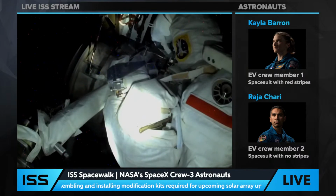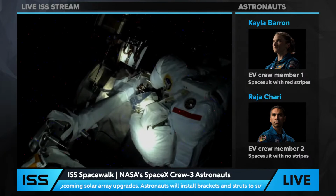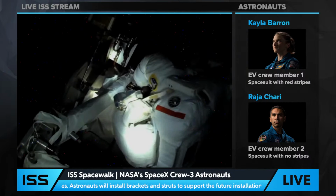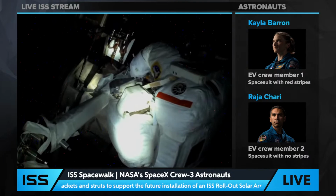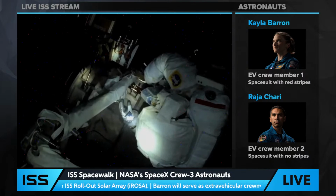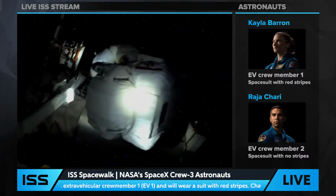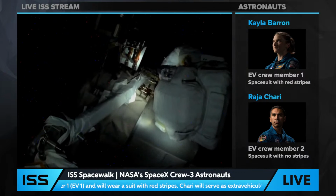I confirm I'm going for a short wire tie. I'll have to give you one of mine. I think I have enough that I can do this side, Roger. I know, you do have to give me one. Yeah, because otherwise you'll be short on the other side when I'm doing the bag. Are you with us, Ike? Yeah, I'm with you. And I hear you guys talking about the wire ties, so you're going to install them on the telescoping end, one near the mid-strut collar and one near the clevis end. Can you just confirm it's a short wire tie? A short wire tie on both, affirm. And I'm going to give her one off my VRT. I still have the reach, kind of like we saw in the EVA run, to be able to get to it. So I'll pass off one of my shorts to Kayla. Copy that. EV2 passing off a short wire tie to EV1.